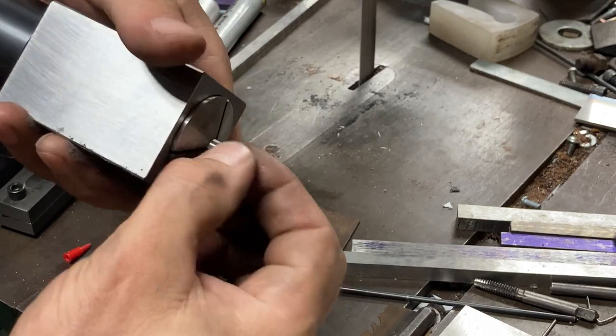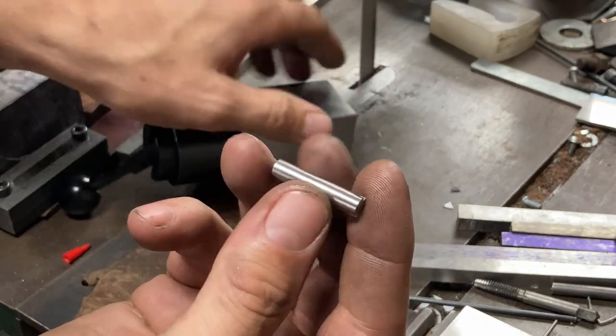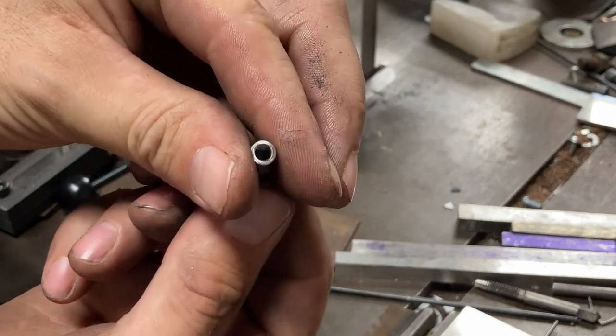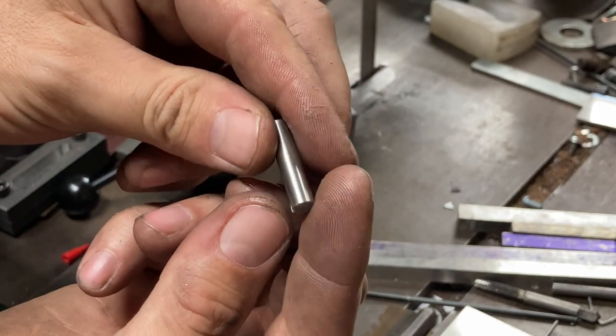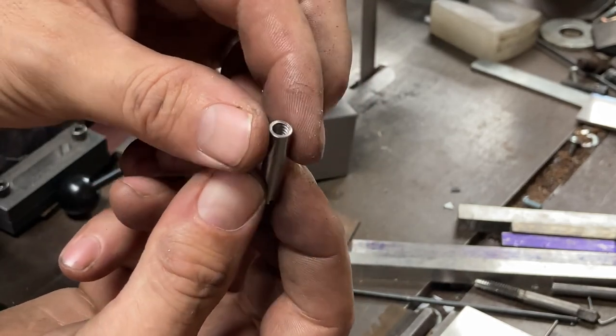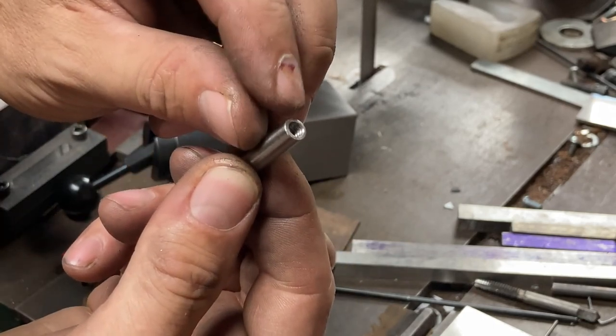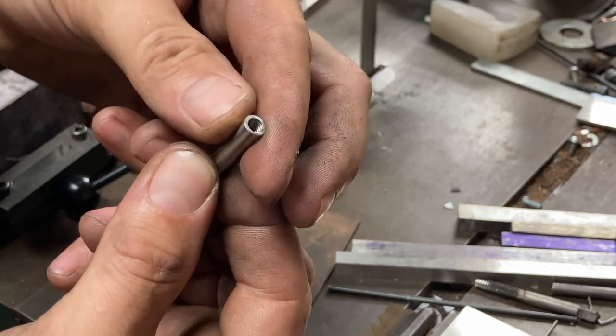And that's all you really need right there. Unclamp, take that out of there, and now we have for all intents and purposes a finished stainless barrel nut for the tang - well, it's not really a barrel nut, it's kind of a blind nut - and this sits up against the bottom of the counterbore in the actual handle block. Thanks for watching guys, I hope you enjoyed the short format video. I'm going to endeavor to do a few more of these in the future, just focusing on specific little techniques instead of entire journeys through a knife build, so stay tuned.